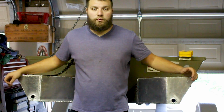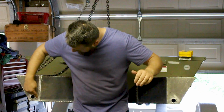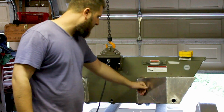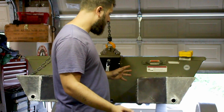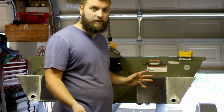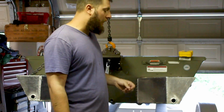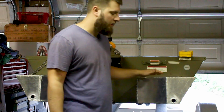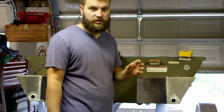All right guys, that is a wrap on this pod video. We got everything welded in here, all the way around. As you can see, we have the chain hoist lifting the boat up. I went around. What I didn't mention to you guys as well is he has a little bit of a bent transom, so we had to compensate a little bit of the pod with the transom to make it work. It was kind of a pain in the butt, so that's why you see a little bit more of some thicker welds up here, just because I wanted to make sure 100% that everything was taken care of and stuck properly.